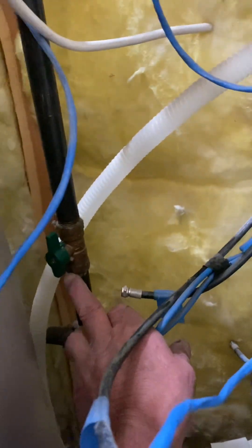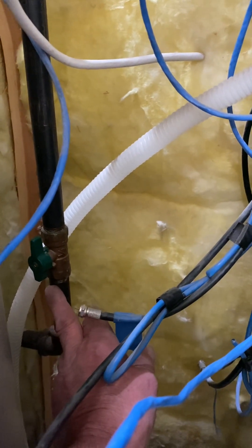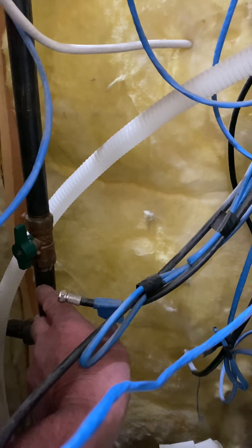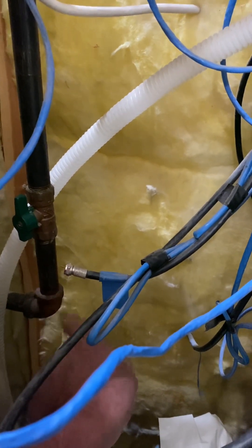Down here, after the cock, you're going to take this out and put in a two-inch and a tee, and then a four and a cap — so that's a drip leg down here.